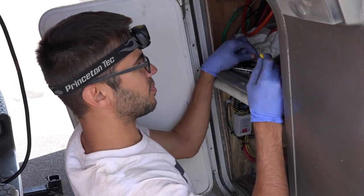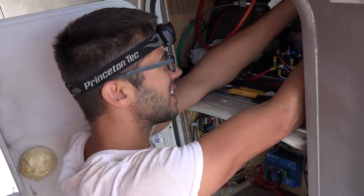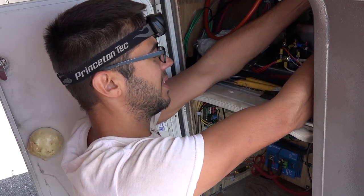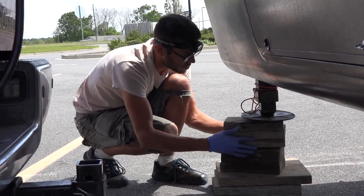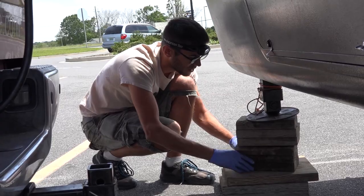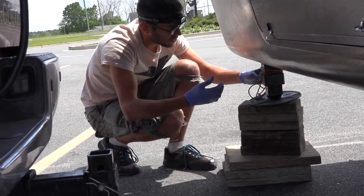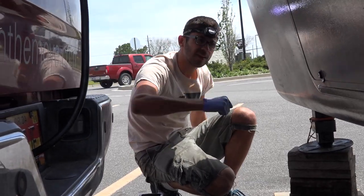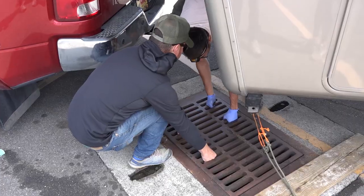I'm putting the electrical back on — all the hydraulic lines are hooked back up. We then had to refill the rams with hydraulic fluid because they were full of air. I'm blocking up one side to prevent it from moving while we fill the other side with hydraulic fluid. Since it's full of air it'll only fill halfway, and I don't want it to suck air back to the other side when we lift the jack.